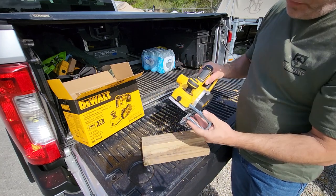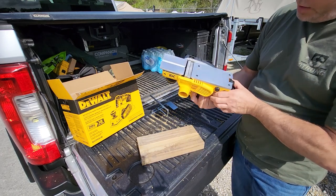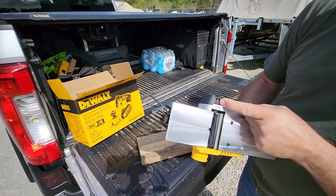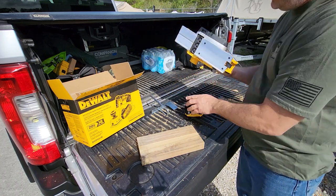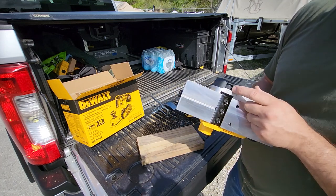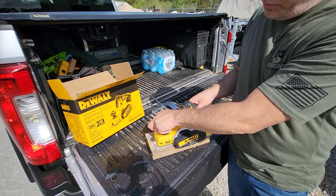You can put this at different depths - if you only want to get the center or just a little bit of the edge, you can do that too. That's a handy tool to have for keeping a nice smooth edge. Inside here you can see the belt - you can maintain that. As you rotate it you see your blades; they're pretty easy to change, that's what the tool in the handle is for. Let's take the battery out - we don't want any power there. You can get to the blades and change them out. There are a couple blades and like I said, 30,000 rotations a minute gives you a nice clean cut.